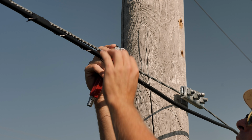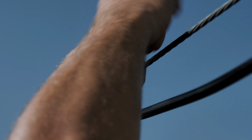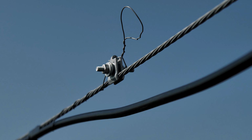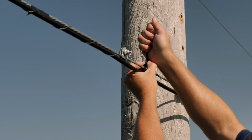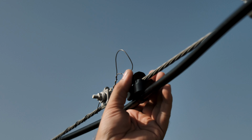Lashing wire clamps are installed to support and tie off the free ends of the lashing wire. The lashing wire clamps can support both single and double lashed configurations. Hubbell sells a variety of cable spacers depending on your application, along with your choice of stainless steel or plastic lashing straps.